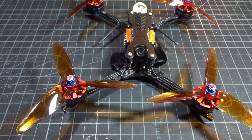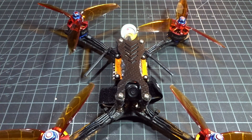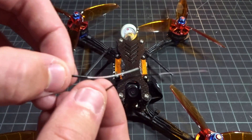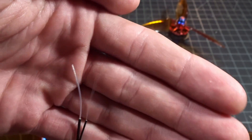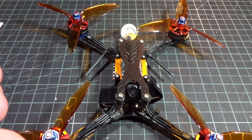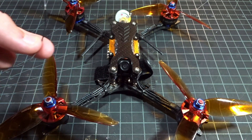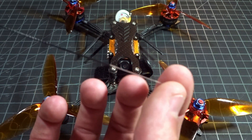Here we are back after testing — let me sum up my thoughts on the FrSky RXSR. I flew about 5 more batteries through this, just racing around my yard and a little bit farther out, maximum about half a mile. I started with the stock antennas — you can see their length compared to an XSR antenna, which is known for being 26mm at 1/5th wavelength. The stock RXSR antennas are actually a bit shorter than that. Compared to the normal quarter-wavelength 31mm antenna, they're quite a bit shorter. I'm not sure what FrSky was thinking, but I didn't have any problems or noticeably worse range. I felt a lot more comfortable once I swapped to the quarter-wavelength 31mm antennas.